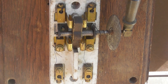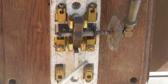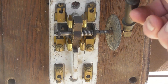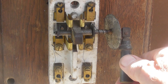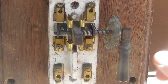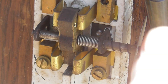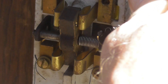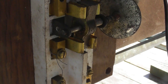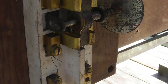This is a very cool main switch — power comes in here at the bottom, it's got two fuses, and I've got an on-off switch. I'll see if I can show how it works. Make, break the current — close in the current. It's a resistive load so there's not much sparkage, but I think you can see a spark somewhere on the side. You can see a little spark at the bottom. Notice how you can see the brass bridge slicing with these contacts.